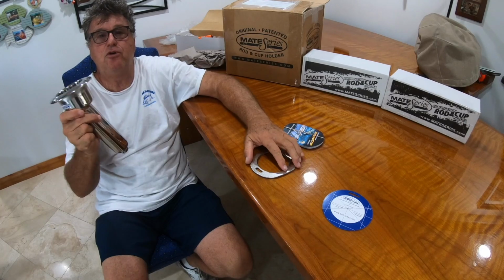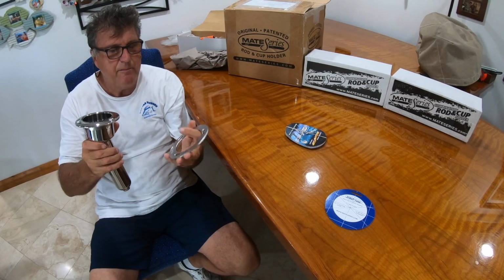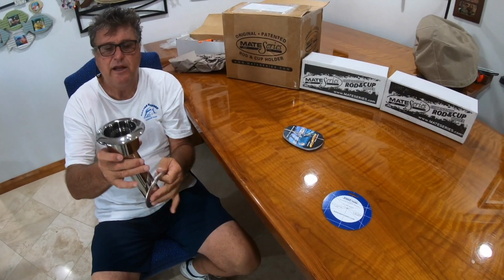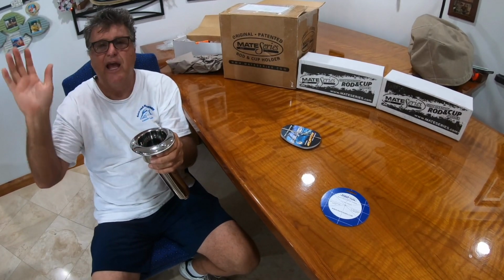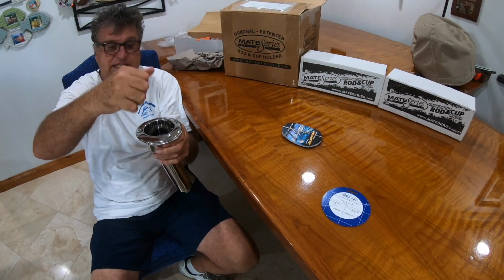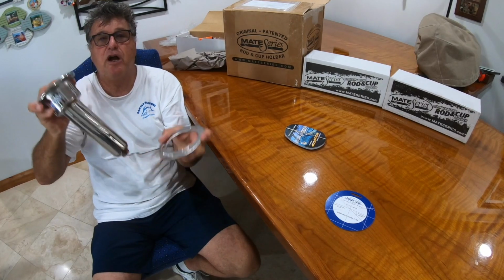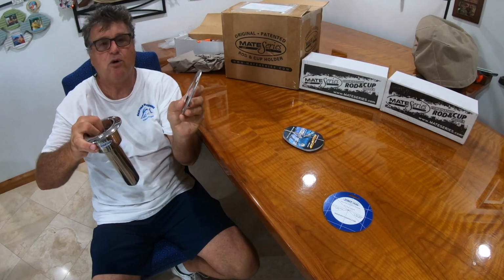Now, we installed 2 on this boat. We didn't show you because it was so hot. We didn't want to video that day. But it's very important when you put a rod holder in for a sunshade to order a backing plate, because we're not sticking a spinning rod in this thing, okay? You could put self-tappers and it would last for 20 years if you're putting fishing poles in it. We're sticking an 1.25 inch stainless steel pole, 5 feet long, and torquing on it. You put in a rod holder for a sunshade, pay the extra money and get a backing plate. It's a world of difference.